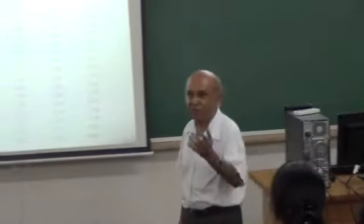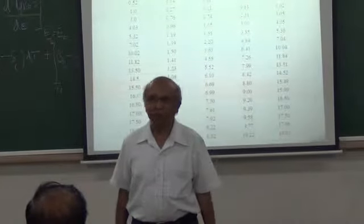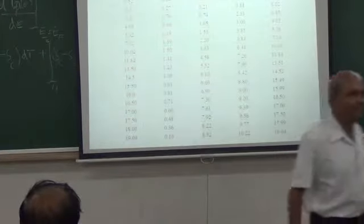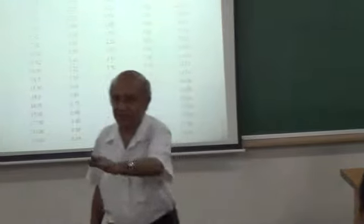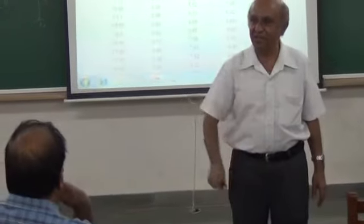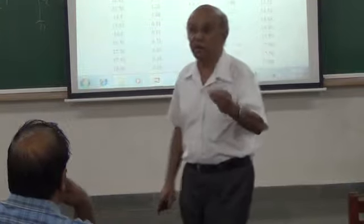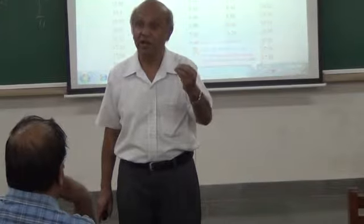We use it. It's very important. You have heard of copper-constantan, isn't it? But the word constantan means something must be constant. What is constant? Yes, that's it. The temperature derivative of resistivity is very close to 0. Yes, it is of the order of 30 to 40 ppm, parts per million per degree centigrade.